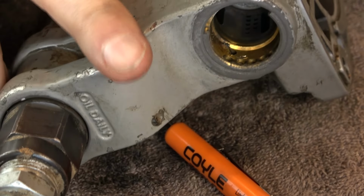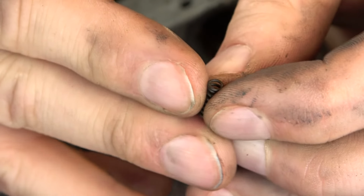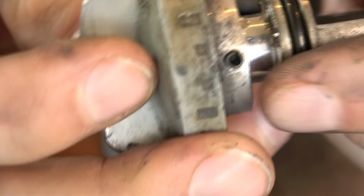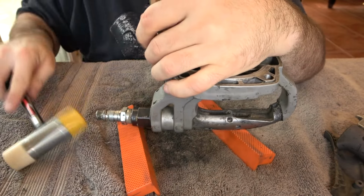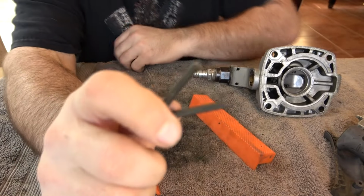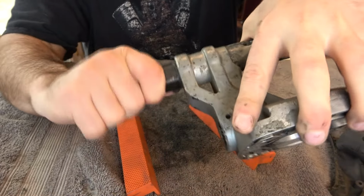And as I checked the schematic, there is also a spring. Here it is, fell out there. This spring keeps pressure on that ball. And there's a hole here opposite this stop pin. There's a hole where that spring and ball goes. Yeah, I'm going to have to take this over to the vise and clamp it in there to do this, so sit tight. There's your two roll pins. And the assembly, I think, should slide out.